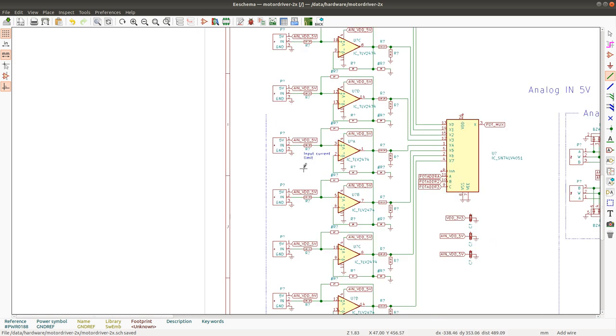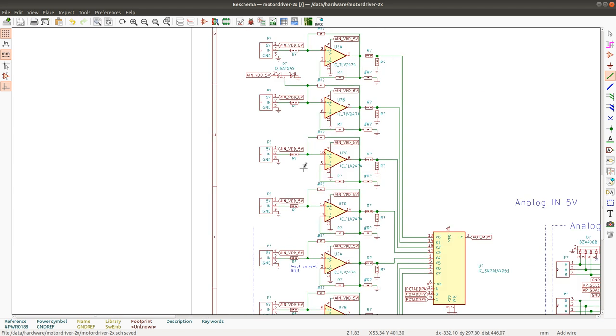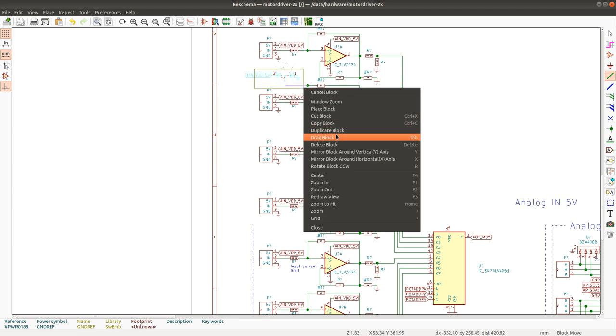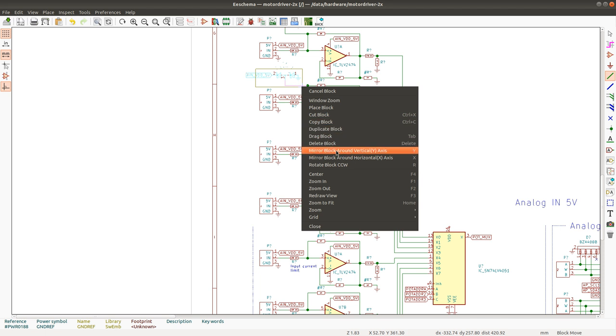I'm not sure how it works though when there is a power management IC like this, whether if the voltage rises on the output here, does it also rise on the input, like on the input there on the VDD 5 volt? That's something that I would possibly want to double check. But since the current is very small, it doesn't really matter, because this current is going to be consumed by the circuitry that's connected to this power rail.